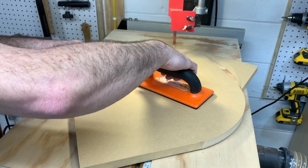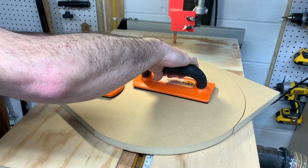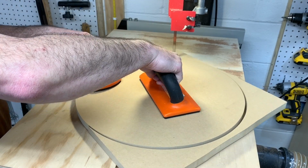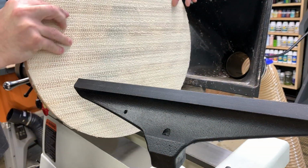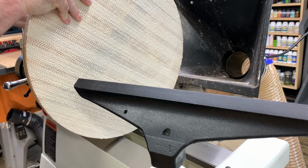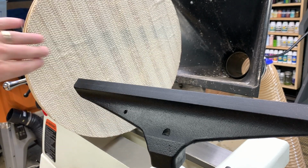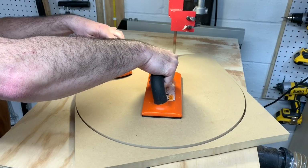If you're wondering, the jam chuck plate is made out of 3/4 inch MDF wood. On a side note, you can use plywood. Just make sure you use a really good grade of plywood, because if there's holes on the side or it's warped, it's not going to come out very good, as what happened to me here.